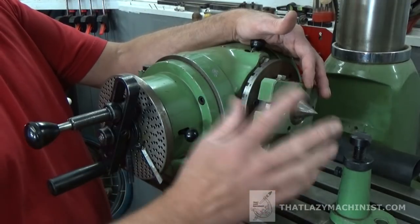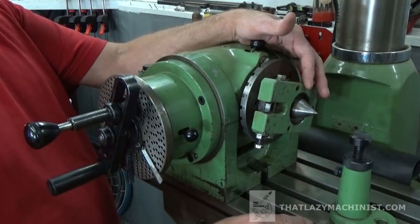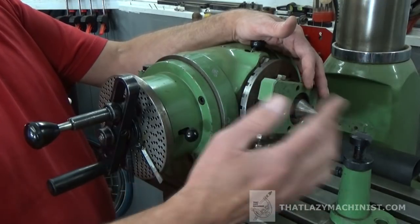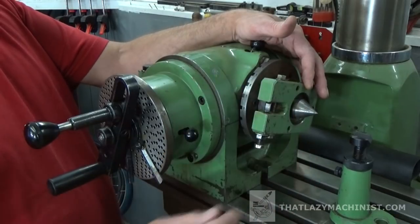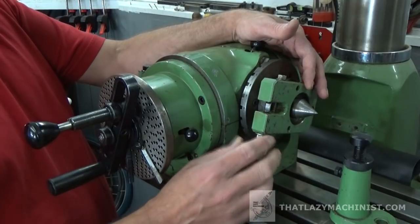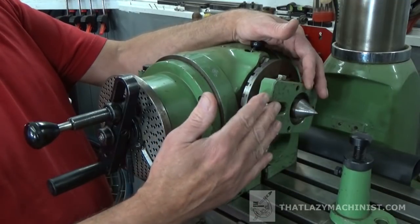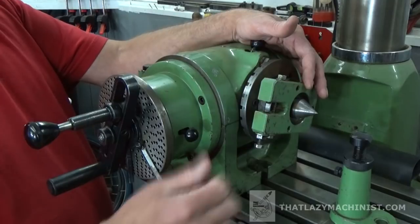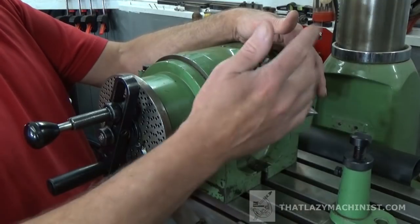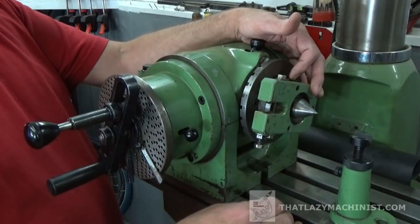You've got to remember, we're not turning here — it's a mill. So when I mill a tooth on a gear, or a flat on a hexagon, I don't want the part moving due to any play between the dog and the drive plate. So once I've inserted the dog and I'm lined up, I want to snug and lock it down so the part will not move while I'm cutting — it'll only move when I turn the spindle. This drive plate can be removed with the center and replaced with a chuck. We're going to be putting a four-jaw chuck on here in just a few minutes.